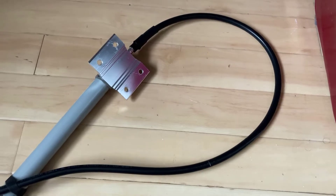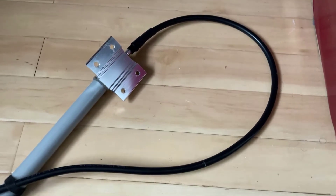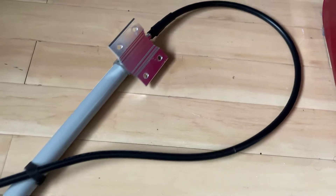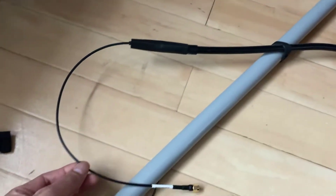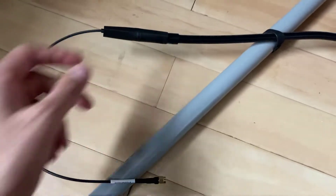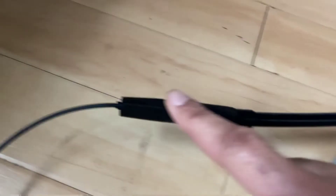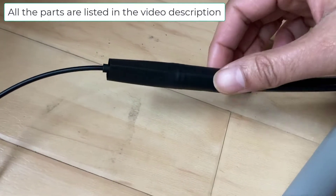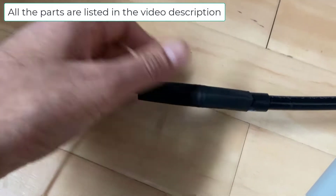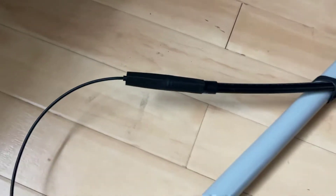The intention is to have the antenna outside but connect it to the miner on the inside. So on the end of the one meter LMR 400 I've fitted an extension — this is an LMR 100 cable and that just connects to there. Where the joint between both of them is, I'm just going to fit some weatherproof seal and tie it around there so that none of the weather elements can affect it.